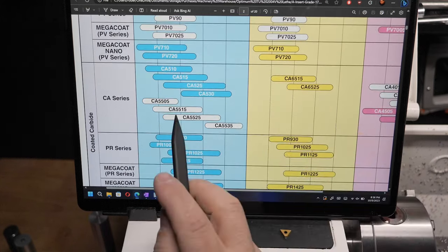For example, the infeed speed, the speed at which the carriage can move across under power, has a minimum speed, and that speed is 0.11 millimeters. It says so on the front of the box, 0.11 millimeters per revolution. So that's a limitation, and I can only change that upwards by changing the gearing. I can't make it any slower. So that's one thing we know.